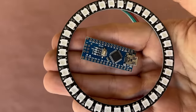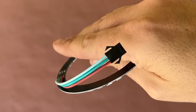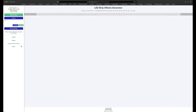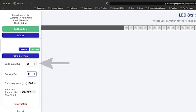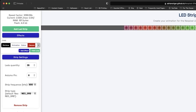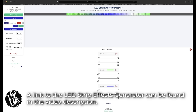It'll be controlled by an Arduino Nano microcontroller. Now I'm not a programmer, but thankfully I was able to find an online tool to help with creating a basic animation. I started by adding an LED strip, adjusted the quantity of LEDs to match the number on my NeoPixel ring, along with which pin on my Arduino Nano would be responsible for data. Then I added the rainbow effect from their effects option panel, and edited the colors to create a simple lighting effect for the inside of my display.